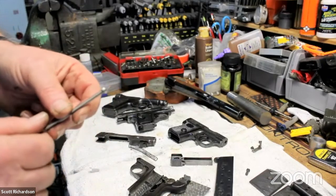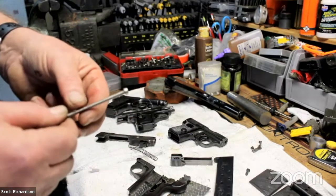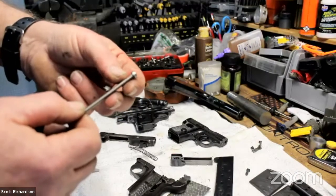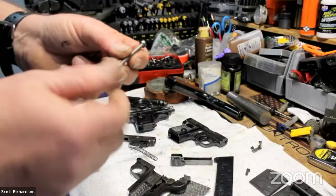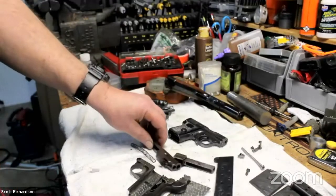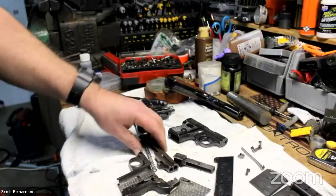The original guide rod would look just like this current one but a bit thicker with a slot in it. I'll probably end up having to make one — you just cut a piece of steel round stock down to size, thread it to the 8-32 tap and die. So those are the pieces. I wanted to show this as a recent example of the things I always run into when taking apart old guns.